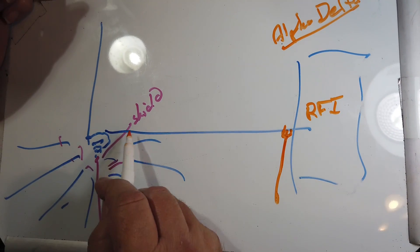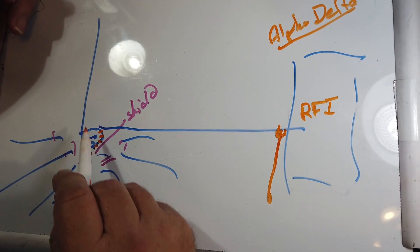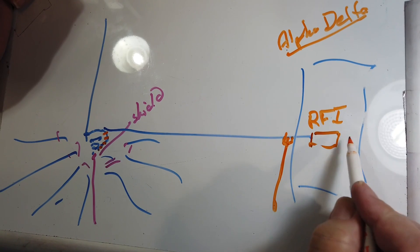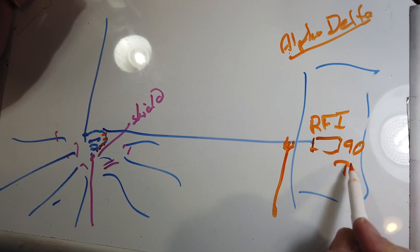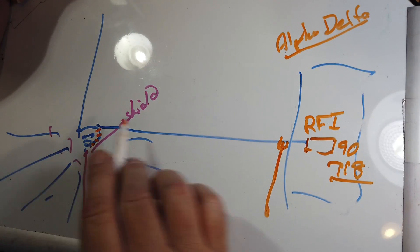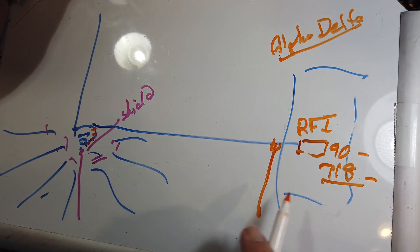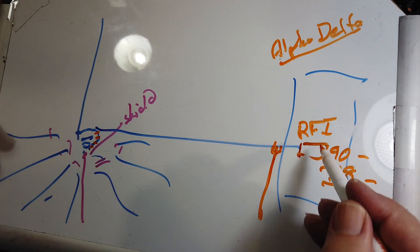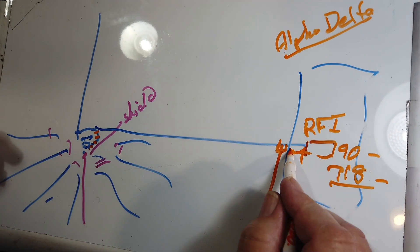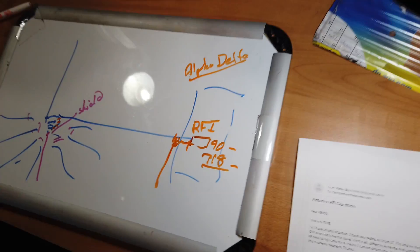If you have a tuner, his coil showed a tap — you could put taps on it to get the lowest SWR. He's probably got memorized by now which tap for which band. But then you've got your two radios, the G90 and the 718. The 718 is a 100 watt radio — try dropping that back to 20. But if you add this grounding, there's a very good chance you're going to be able to run both radios without having any RFI issues. The radios themselves have a separate ground wire going from the station ground out to the ground rod, and that will keep much of the RFI out of your shack.